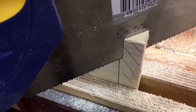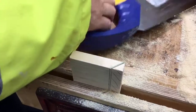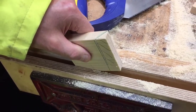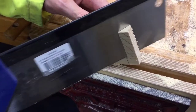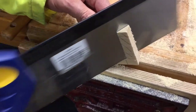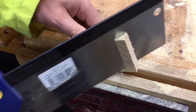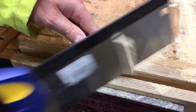Keep it accurate, keep it vertical. If you go wrong you may have to make another one. Now I don't want to cut my vice jaw - these are the jaws of the vice - so I can come slightly out. I'll just try it this way because I've got a nice line there. Not pushing too hard - keep the pressure even, not too hard. Slowly.